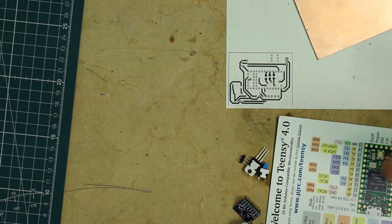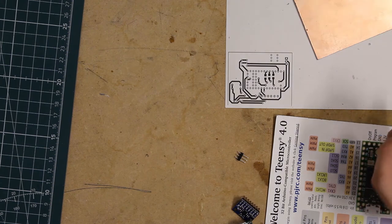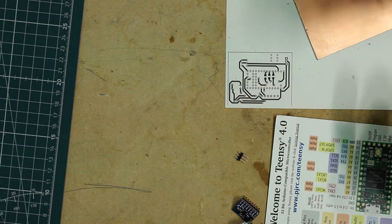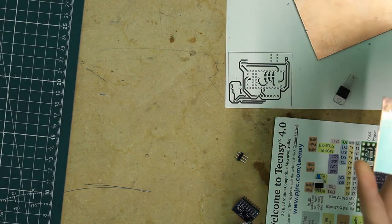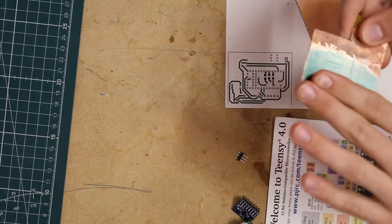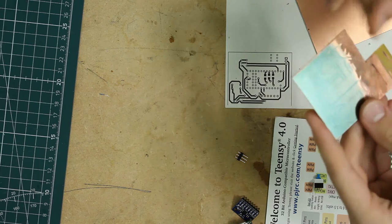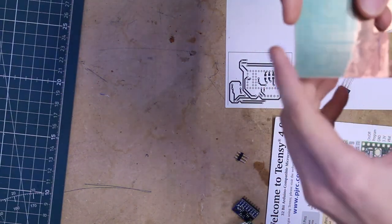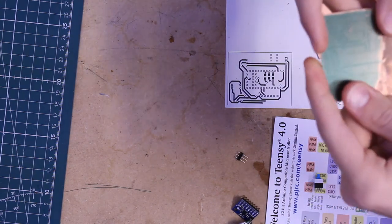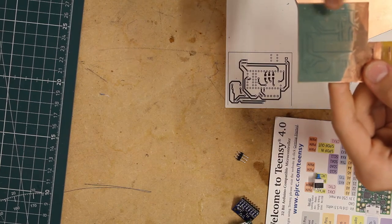So the next step that I'm going to be doing, and remember, when you're designing your flight controller for the TVC project, you're not going to be having to make the board, or at least not make the board like I'm making it. Normally I would use what's called a photoresist PCB board, which is basically when there's a photoresist layer on top of the copper, and that layer kind of works like film in a camera, where when you expose it to light, it develops. Where you expose it to light, it gets hardened, or some sort of chemical reaction takes place where it doesn't get wiped away, and it forms a layer on the copper that blocks the etchant, what we're using to dissolve the copper